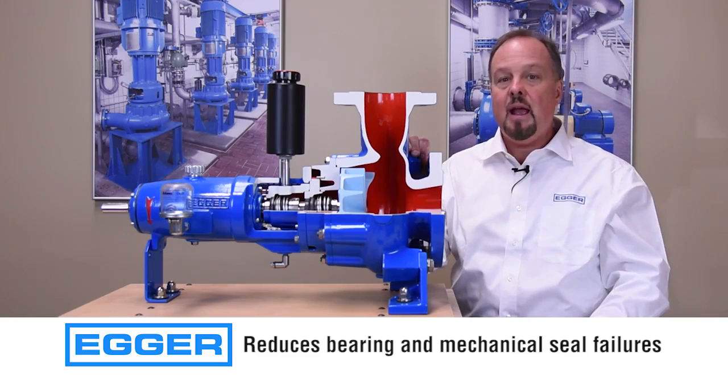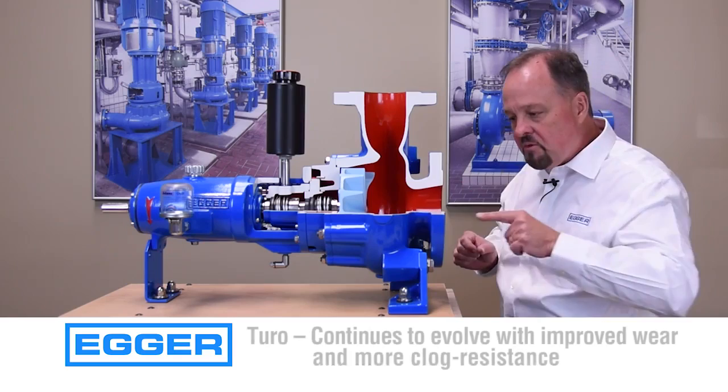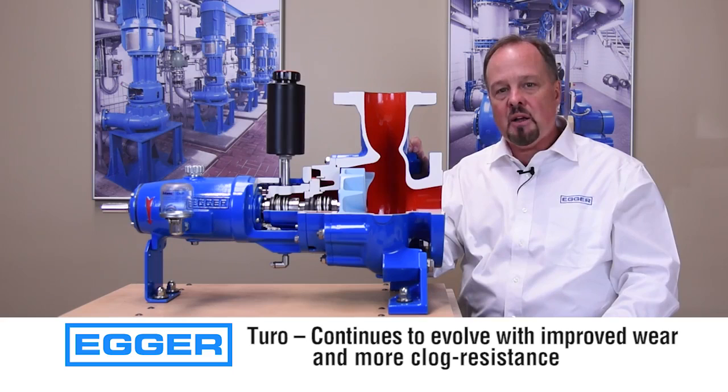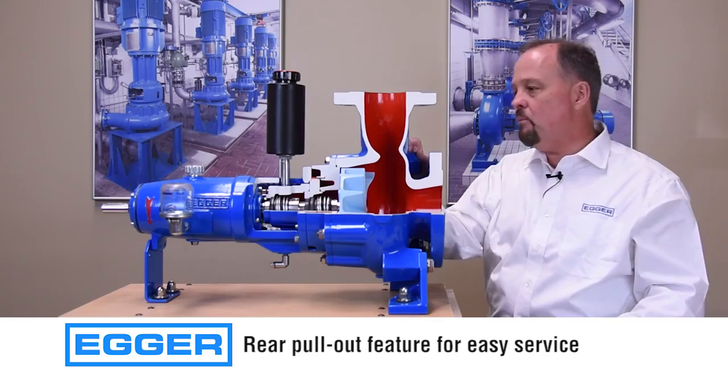Our longer suction nozzle directs the flow to the eye of the impeller. Then our shaped impeller nut helps to redirect the flow away. This prevents solids from clogging and wearing the pump. Turo has a rear pull-out pump design feature.